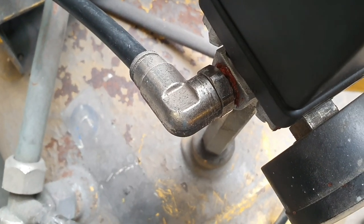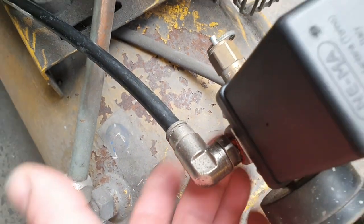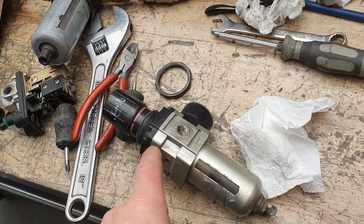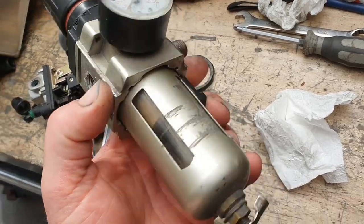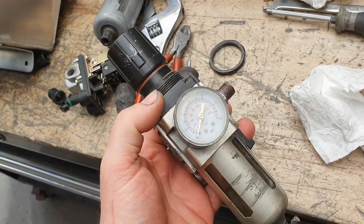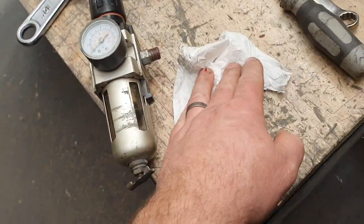That's why I use thread tape. Don't use the orange sealant on high-pressure air — it's not going to work. Turn it off so it doesn't fire up because of the leak. The needle valve arrangement seal on the top is stuffed, so this regulator is done. You probably won't be able to buy a rebuild kit for it — just chuck it in the spare parts bin and buy another one, which will be about 50 bucks.